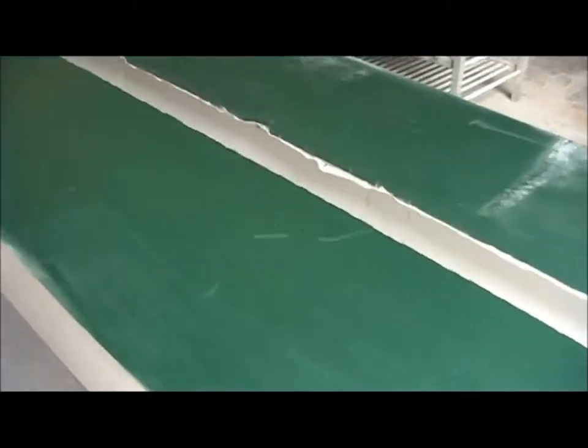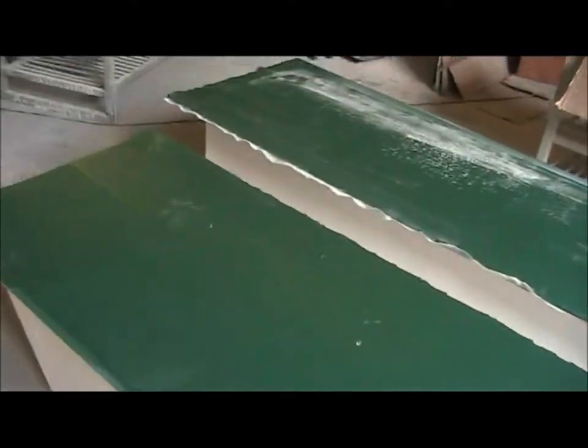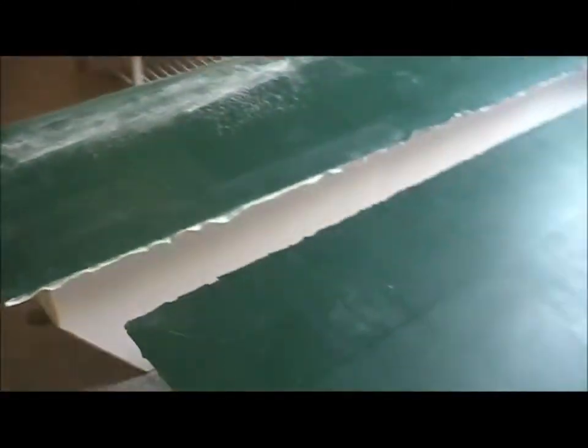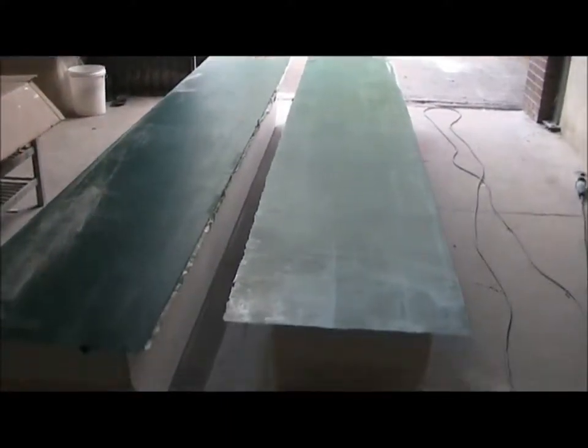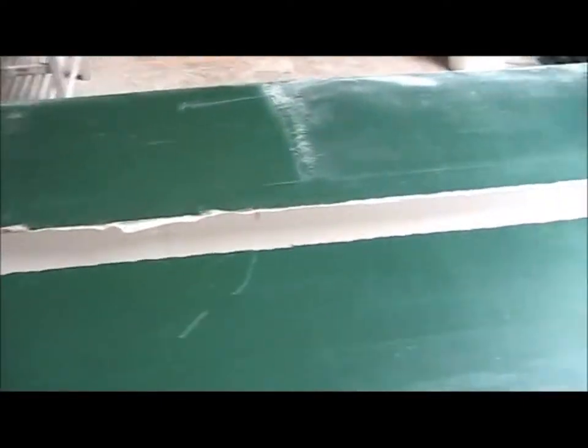A bit more progression — I've cut the lids now. The lids were joined together in one sheet and now I've cut them. So now I can mark around underneath where the other flange is, mark all the way around, take it off again, and then cut it. That way you'll get the flanges exactly the same. Then I'll polish them up.